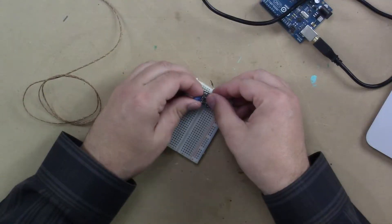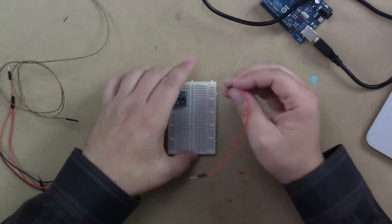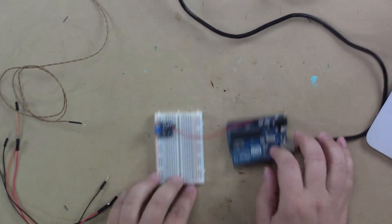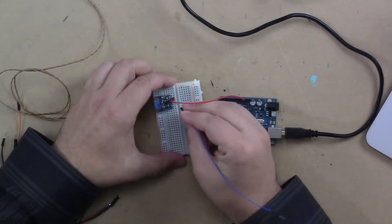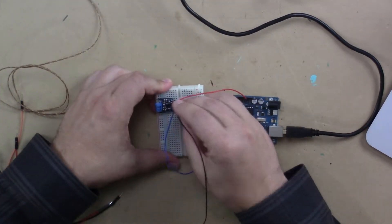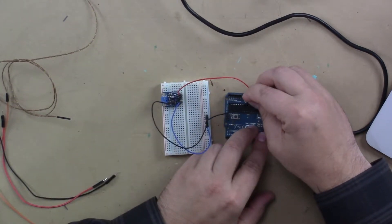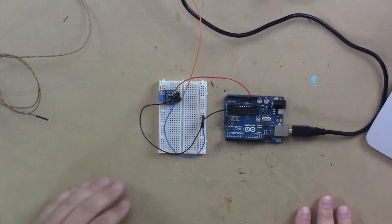So let's wire this up. Put it right here on the breadboard and just a couple of wires and we'll be ready to go. First one is positive 5 volts — attach that to the Arduino. If you read the documentation, you can actually connect it to 5 volts or 3.3 volts, and that changes the range that it can read. Then I have a ground that I'll put onto a ground rail, and another ground over here on pin three that I'll put to the ground rail. Then I'll take my ground rail and connect that to a ground on the Arduino. Then I have the signal wire, the analog voltage out, and I'm just going to leave that open for now so we can take a look at the code.